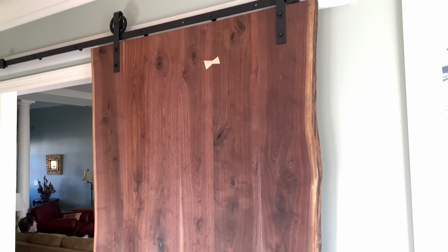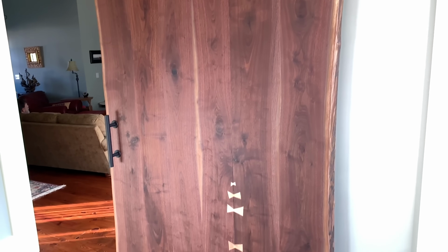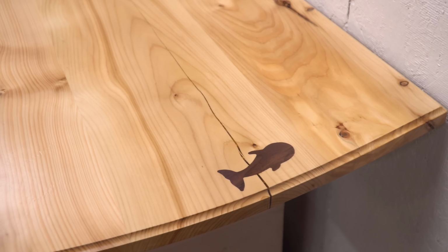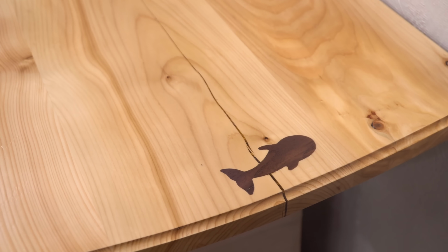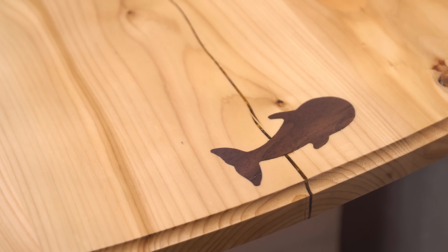thing. No matter what the name is, it's an inlay that spans a seam or a crack to mechanically lock the two sides together. The key is cut lengthwise from solid wood and inlaid perpendicularly to the seam being stabilized. The result strengthens the crack and keeps it from getting worse over time. It also adds a decorative focal point that a lot of people like.